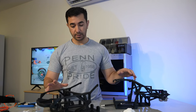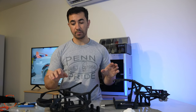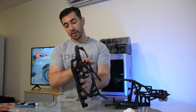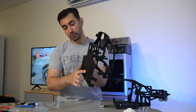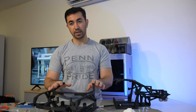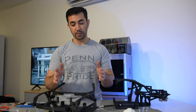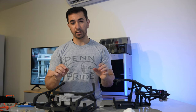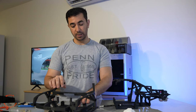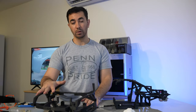We'll leave it like this for a bit so the resin cures, and then we will insert the brass nuts. The good thing about these bow ties is they squeeze the two parts together and the excess material comes out, making it one part. So the chassis will not end up longer or wider — sometimes with gluing you can have a one millimeter gap, but these bow ties always squeeze it to the correct size, just like one part.